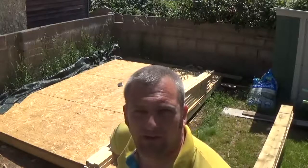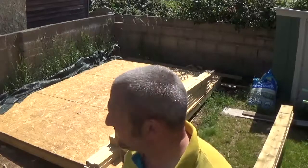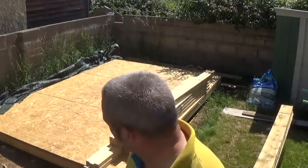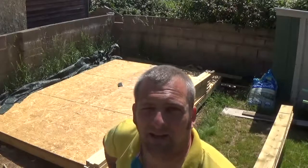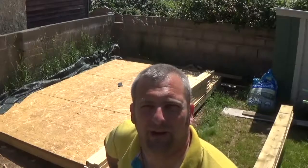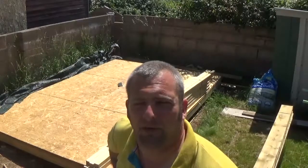I've got the circular saw out, I've got the tape measure and pencil. So I'm going to get the nail guns out and all that sort of stuff and set to work. The good thing about having the base done is you can use that as a nice flat base to put all your frames together, and once you've done one you can just put it aside and build the rest.